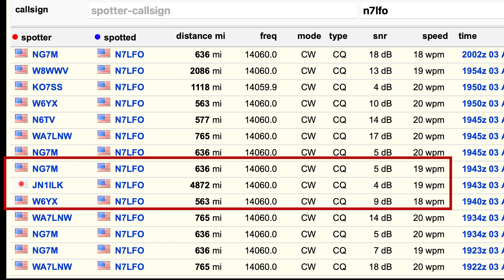At this point I noticed some buzzing on transmit with the TrueSDX, so I swapped over to an 11.2-volt lithium-ion battery pack. That fixed it and it did get some RBN hits — NG7M was the common thread, reporting just slightly lower than the Hilltopper but still comparable. Notably, I picked up my only Japanese station using the TrueSDX.